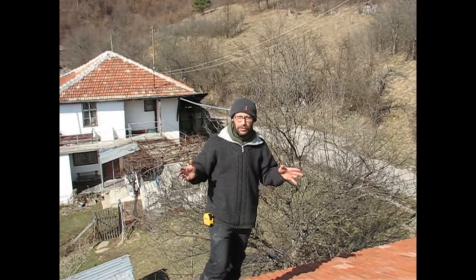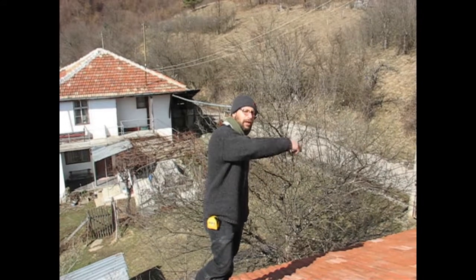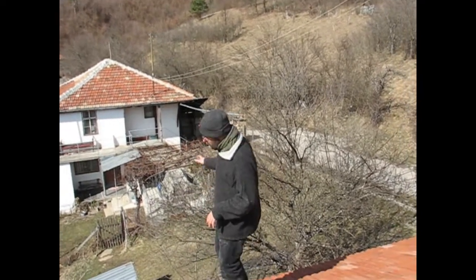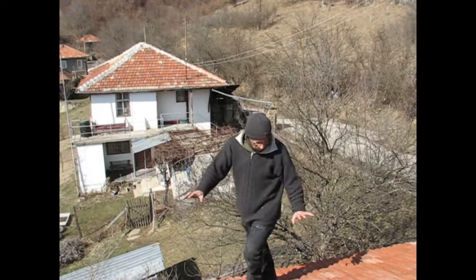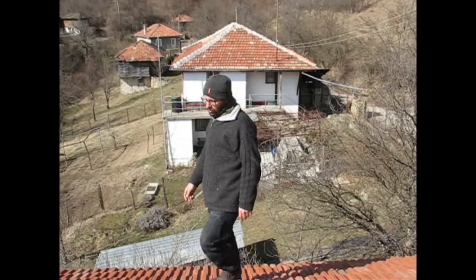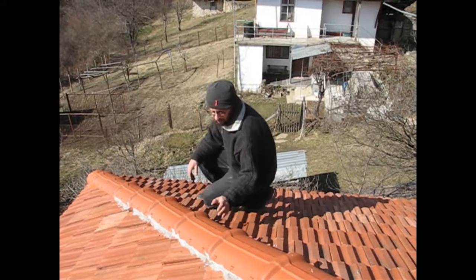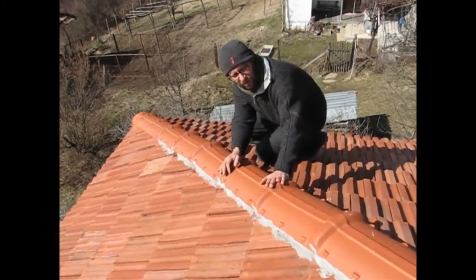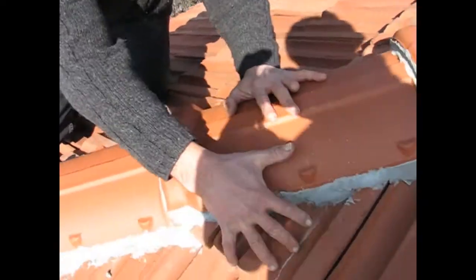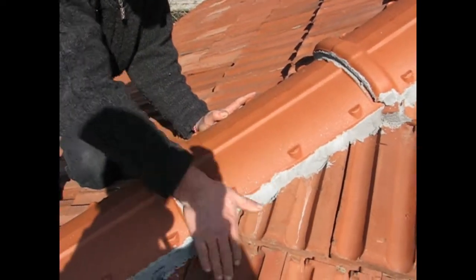It's wise to inspect a roof in a rhythm. I like doing clockwise — I start at one point, walk around the whole roof in a clockwise manner, and come back to that same spot before going off the roof. Keep away from the overhang. I'm looking for broken tiles — I can't see any and I'm very happy. I come closer to inspect the ridge caps. I want to see that they've got mortar underneath them and that they've been cemented properly. I don't want to see too much cement packed on top, because water can come in from there and go under the cement. You want the mortar to come in from the bottom and be cleaned off perfectly so water slides down and goes away.